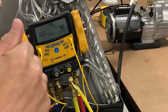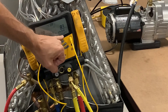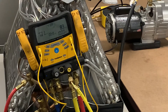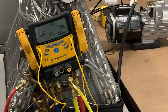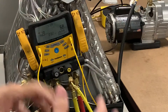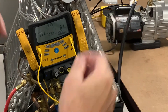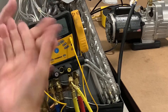The goal is that the 10-minute timer will remind you to go outside and check the microns. The high alarm set for 1,000 will go off if you fail your test. So if you're in there wiring up the air handler and it trips — you've got to go find out what's leaking. Is it your tools? Is it your system? Do you need to vacuum more?